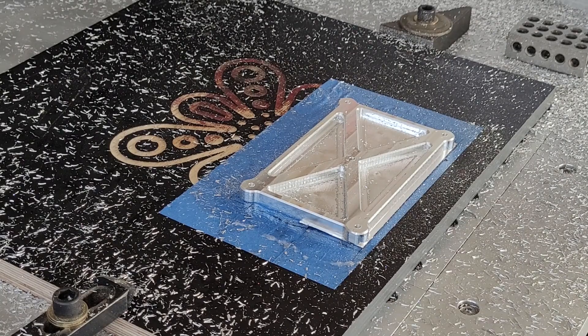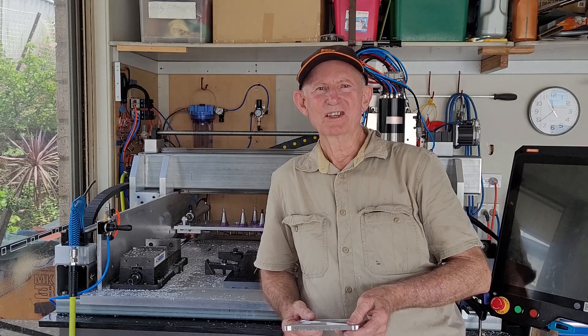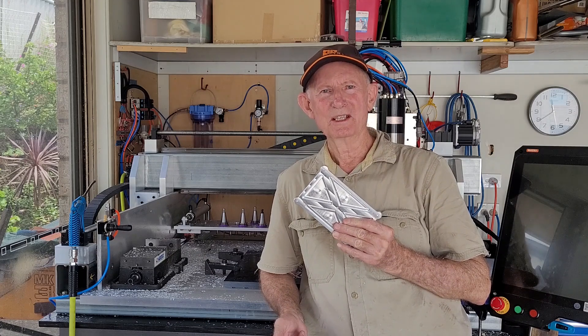And we're all finished. Now for the conclusion — how did the mist coolant system work? Works fine. Not nearly as messy as spraying CRC out of a can. The program turned it on and off when it should. All went well. A couple of successes with the chamfering operation — first time I've had that working properly. I did find that the long 6mm cutter was a bit too flexible, and probably the cuts were a little bit too aggressive for it — got a bit of chattering. I'll probably go back to my old 8mm with a 4mm step over; saves a lot of time. Anyway, hope you enjoyed the mist coolant video. There'll be one on a budget coolant system for my other mill at a later date. Thanks for watching, catch you next time.